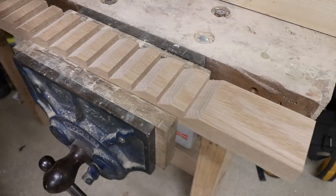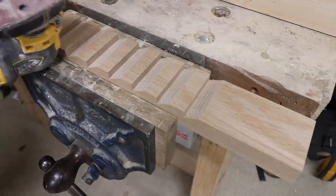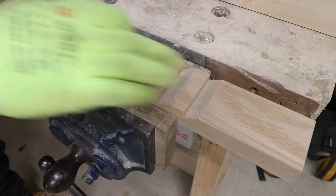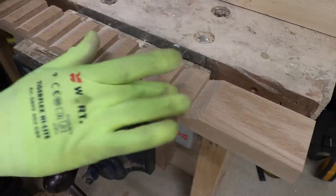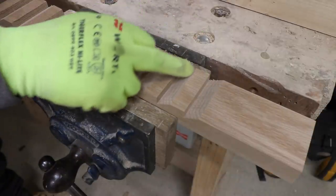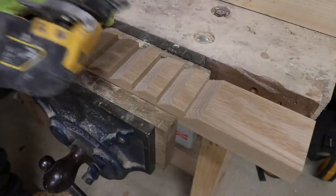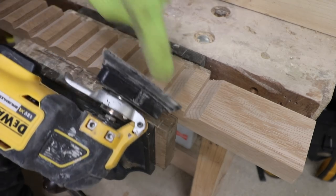Right, so once we've done the cutting on the crosscut saw with the 30 degree cutter, it leaves this beveled edge slightly rough. It's just a rough texture where it's cut from one direction. So if you run your hand over one way, it's quite smooth. If you go against the grain at which you cut it, there's quite a bit of roughness there to that timber. So I used to sand that out with a multi-tool like this, because it's got quite an angled bed.